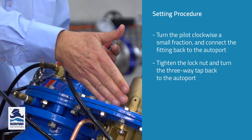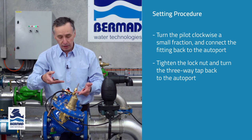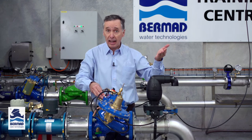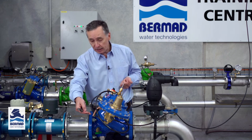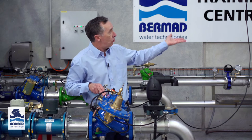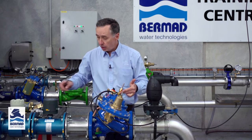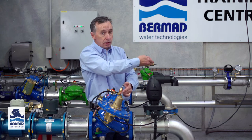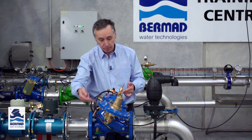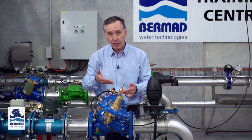It's exactly on line here now. What we will see is that the valve will remain closed because I'm at that top water level. Now what I can demonstrate with the external bucket is that I can drop the bucket by half to one meter, and when I drop it to that level we will start to see water coming out of the vent tube and see the shaft opening. I can re-lift the unit and see where the top water level is reached and see the valve closing. So I'm going to lower and raise the level, and you will see when I hit the low level water coming out through the bottom and the valve opening, and conversely when I go back up to the top you'll see the valve close.